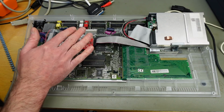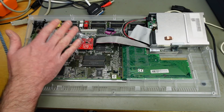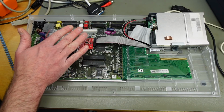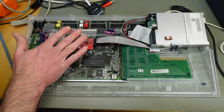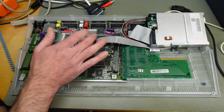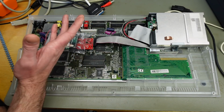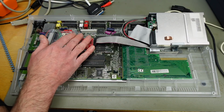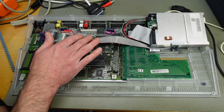These early 90s electrolytic SMD capacitors are basically all very unreliable. They were not having the production process down completely, so they are all leaking, or most of them I've seen are leaking and destroying the circuit board underneath with the electrolyte that they literally leak out of their cases. It's a good idea to use modern electrolytic capacitors to replace the original ones and not use ceramic caps.